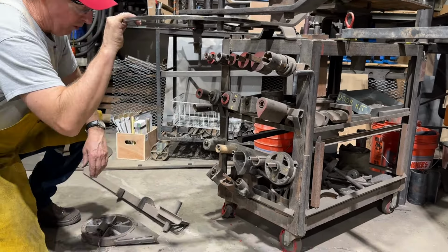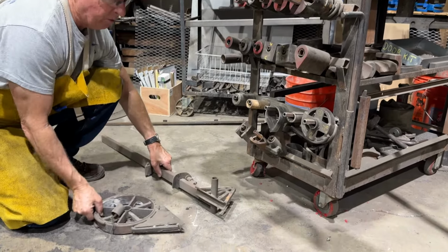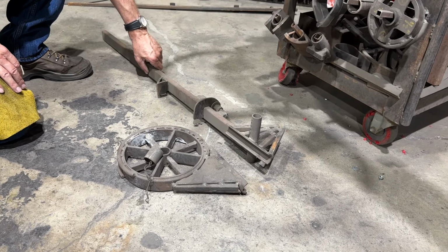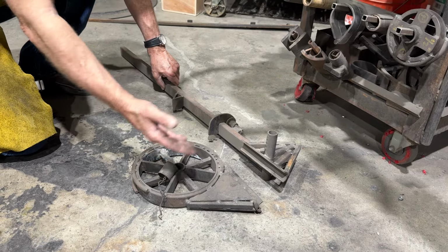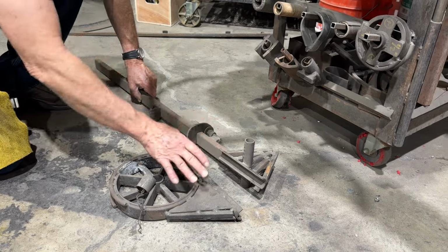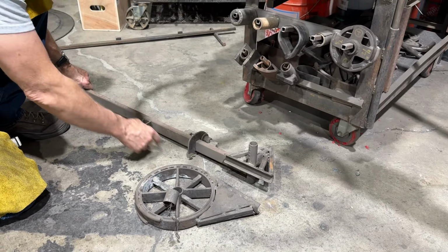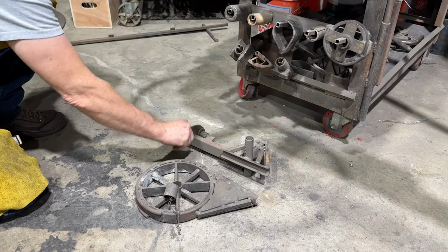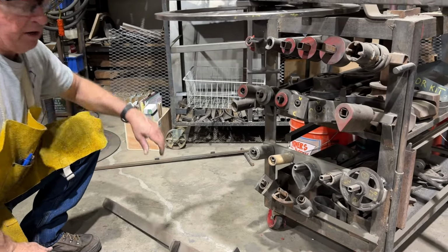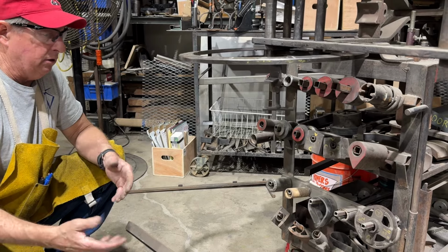or you may have a dedicated project where you have to do a lot of bending. I had to bend some 1-inch aluminum tube, and I had to make 4,800 bends, a lot of bends. So this is a setup where I have the radius that I'm going to need to bend with a setup to capture the tooling. And then I've got essentially a flag fixture here where the first bend occurred here, and then I lifted this up, and then the second bend occurred here. My philosophy is that if you've got to do a lot of them, then you really spend time on tooling so that everything comes out quickly and accurately.